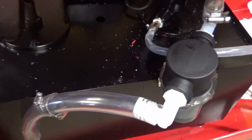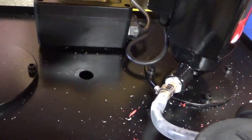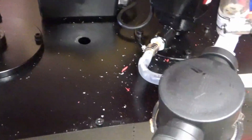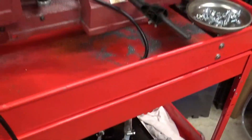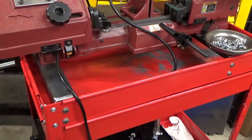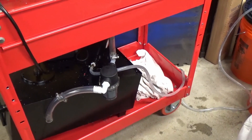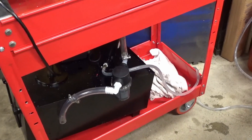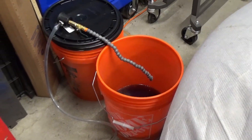There's already a hole in the top of the tank, which I assume is just a vent, although the tank is not sealed. When I tilted it a little too far on its side, liquid was coming up around the edges. So I'm just going to stick the temperature probe down in that hole — that should be fine. I'm going to mount the thermostat to the back side of the saw so it's not in the way but still easy to get to. The only downside is I'll need to keep everything plugged in so the thermostat can keep the coolant from freezing all winter.